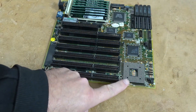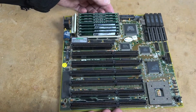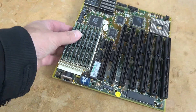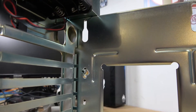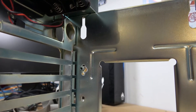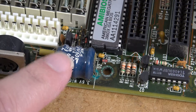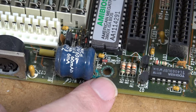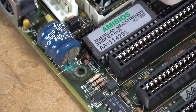We have a socket down here which is likely a combo socket — we'll have to look into that. But first we need to check out this motherboard and look at some of the damage I've noticed. There was some damage on the motherboard tray concentrated on this screw hole. This was the one screw hole that was supposed to hold a physical screw, and that was gone. Either it corroded away or fell away, but when the battery leaked all of the fluid went into this hole.